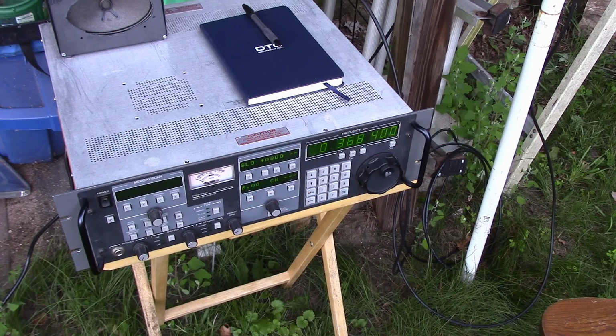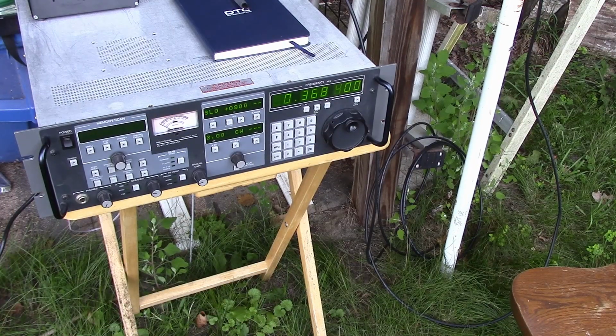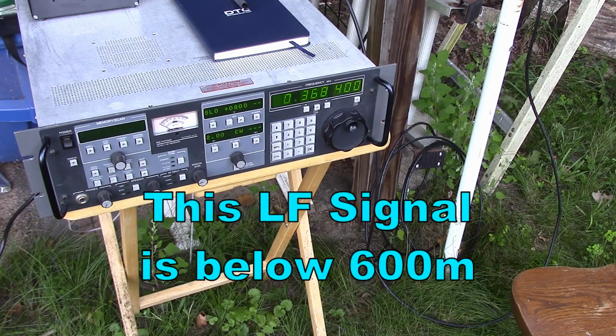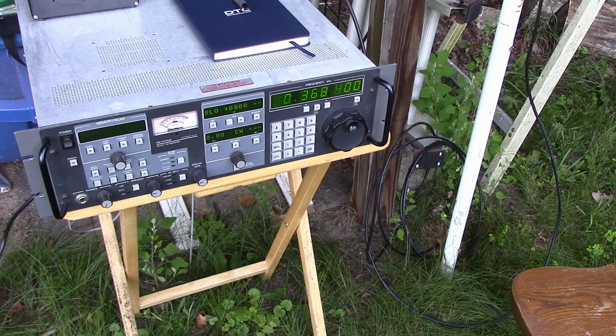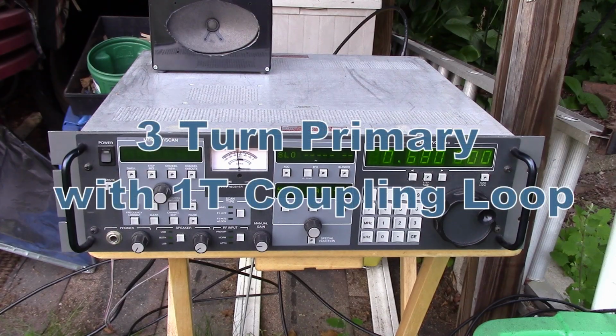I think you'd have a pretty good situation with a tuned all coax type solution. So for 600 meters, or what we call 630 meters, I think the 3 turns works very well with just a regular 4-section variable, or perhaps a 3-section with an 820, or a 2-section maybe with a 1500 puff across it. Single 24-inch loop that's located towards the top, and I'll show you that.